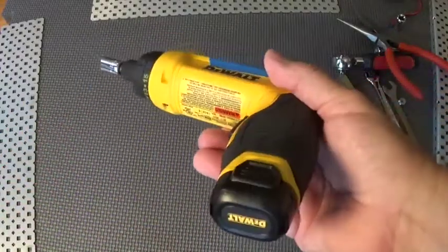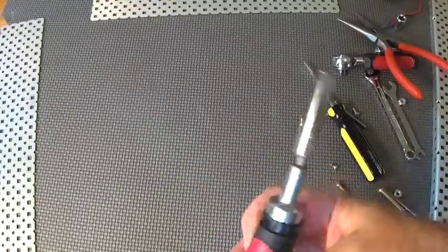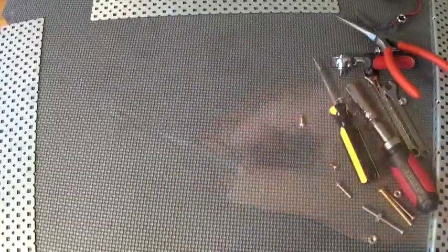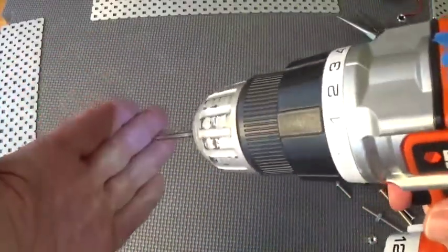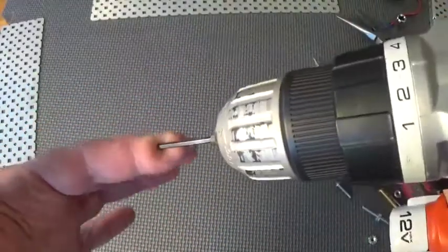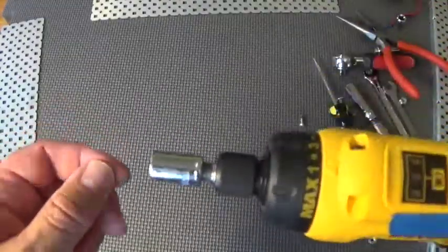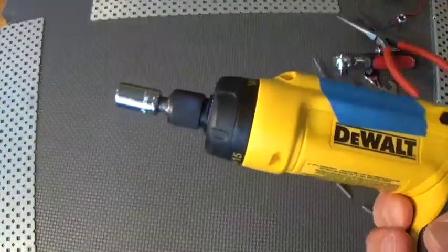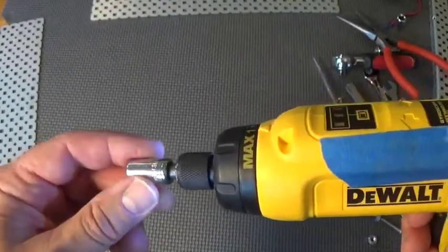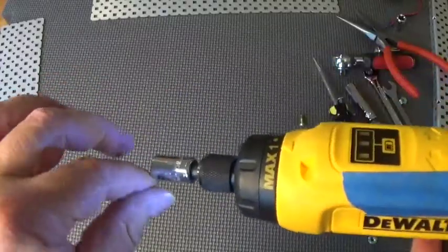If you're just beginning, I wouldn't get one of these — I would stick with the ratchets. You can do a lot with those, and sometimes they're just as fast as messing around with an electric screwdriver. If you're using something like this, just make sure you're careful — you don't want to get your fingers stuck in there. Also, if you're using this to put on a Nylock onto a screw, don't go so fast. The friction with the Nylock will create a lot of heat, and that can melt the nylon and ruin it — it can also get so hot it will burn your fingers.